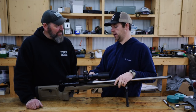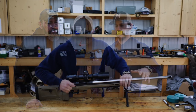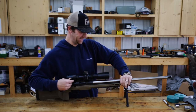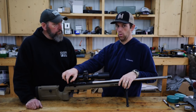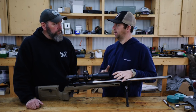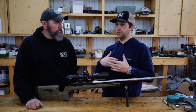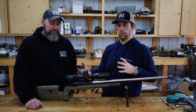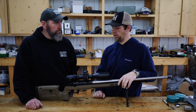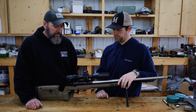Another thing I didn't mention is that this action has the same footprint as the TL3 or the Remington 700. One thing you're going to notice on this action — it actually has an 11-degree swept bolt. So it will literally fit in any Remington 700 inlet. A lot of guys with custom actions have a straight bolt, but this will actually fit in any 700 inlet. If you want to do a chassis, stock, however you want to do it, it's ready to drop in.